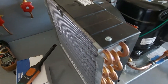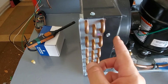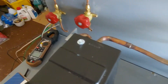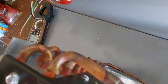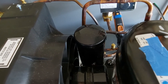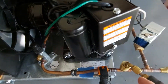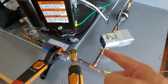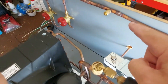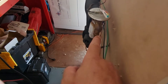The airflow comes in the front, through, and out. This condenser is a series condenser, not a parallel — there's no manifold, but it has three rows that the refrigerant passes through, to save space. The refrigerant comes out of the condenser at the bottom and comes through into our receiver. The receiver is a storage tank designed to hold liquid refrigerant and ensure that only liquid refrigerant comes out into the liquid line. The liquid line comes out of the bottom of the receiver. I have a liquid line solenoid — we'll talk more about that later — and it comes through my filter dryer.